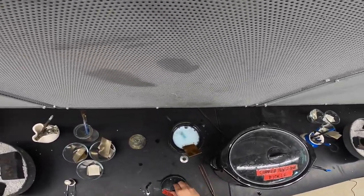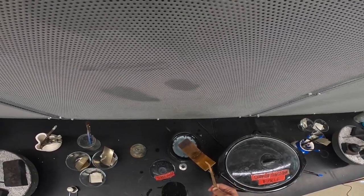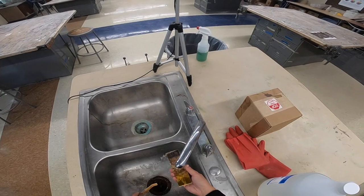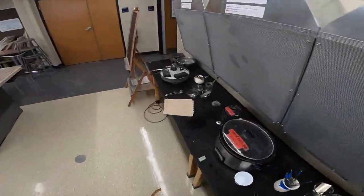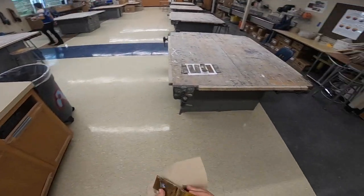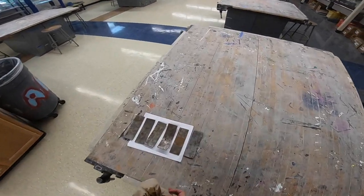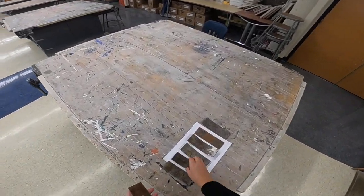I've already flipped it — see, it's like a little jacuzzi, and that's how you know the super pickle is working. I just want to get the majority of the fire scale off; if there's still some leftover that's okay, we can sand it off later. I'm going to rinse it in the sink, getting all the sides, making sure it's mostly back to brass. Then I have some paper towel to dry off my metal and get some of that lingering fire scale off. You want to make sure it's pretty dry for this process, because that's how the rust ends up on these texture plates — so the less rust, the better.